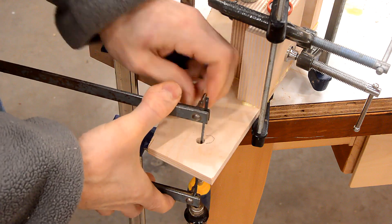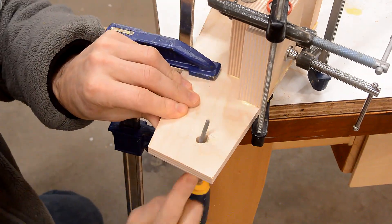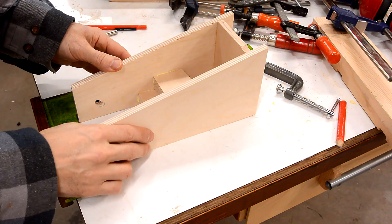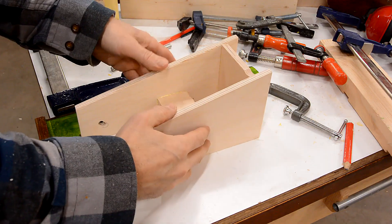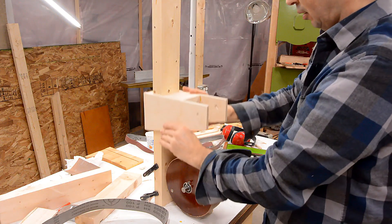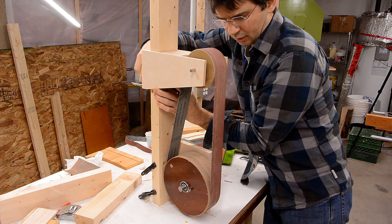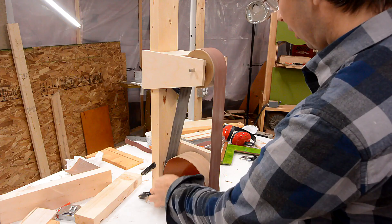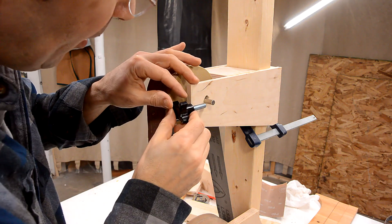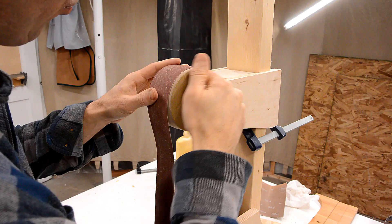I realized I need to extend this slot a little bit, so now I have to do that with a handsaw. I'm going to rely on my workbench and a square to keep this part aligned. The belt is tracking a little bit to the left right now, and my plan is to have a screw pushing this shaft back, which pushes it back and up a little bit, and between those two that should really move the belt to the right.